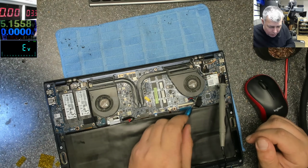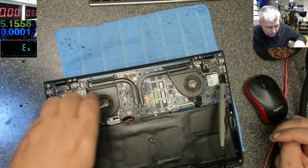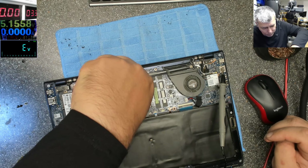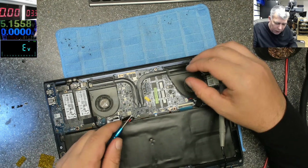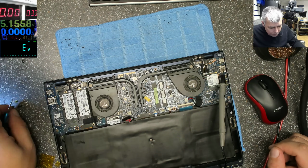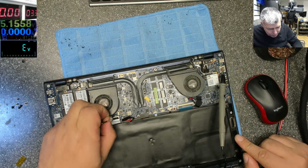So something is wrong around the Super I/O, something is wrong here. It's wrong even with the 5 volts, it's shorted, that power rail is shorted. When a high voltage hit a power rail, everything on that power rail gets faulty. Most likely. So even if I want to help the customer, probably I can't. It's way too damaged, way too damaged.